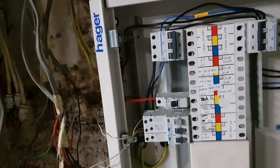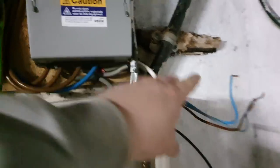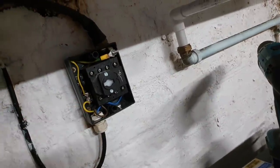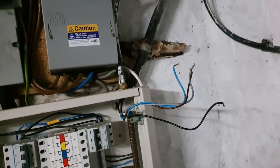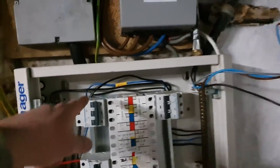If I get everything looking nice and neat and he comes in and says spot on, she's passed, we're good to go. If there's anything I've missed it ain't going to cost the earth to get it fixed. Just little things like this three-phase cable here running over to the cellar cooler — they've come off the cellar cooler when the guys installed it and they've just taken a single phase out. We don't need a three-phase box there, so I'm going to get rid of that three-phase socket and run a single twin-and-earth across there, or we might even terminate it straight into the fuse board.